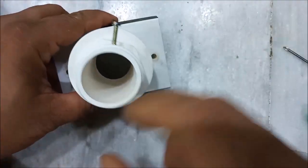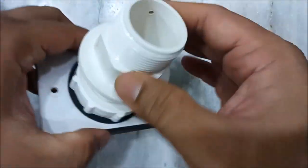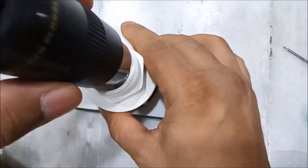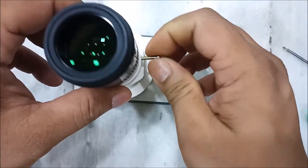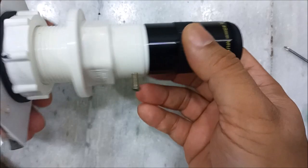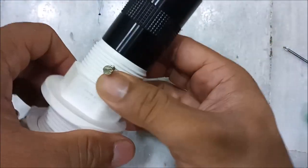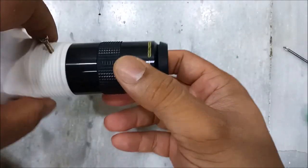It's a complete single piece with no joints. It's all 1.25 inch inside diameter so you can place your eyepiece and tighten the thumb screw. I'll get better thumb screws - just for reference I'm showing you how you can place them. I'll put two more thumb screws at 120 degrees, so once it is in motion during use I can use any of the thumb screws to remove and fix the eyepiece.